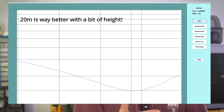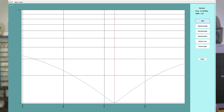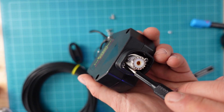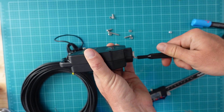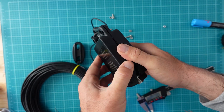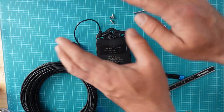If you're not able to elevate the antenna properly, especially at the feed point, your results may vary for the worse. That is something to think about if you're going to be doing portable ops, because in a typical park situation you may not always have the time or the space to carry two clampable masts. And this wire — well, it's heavy. It's well-built, it's rugged, no doubt. But it's not exactly lightweight. You need some serious support to keep the antenna elevated without a significant droop in the middle.